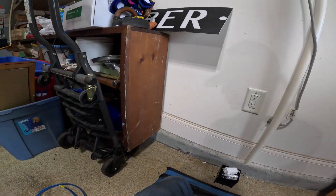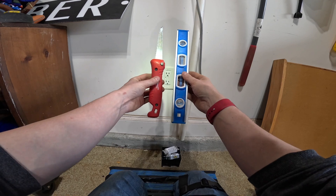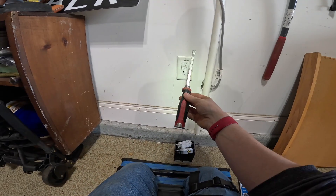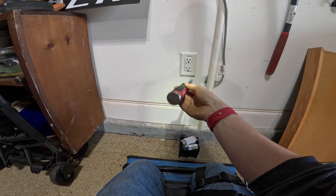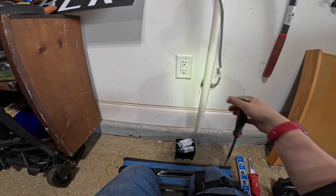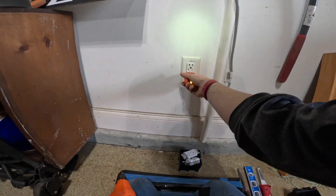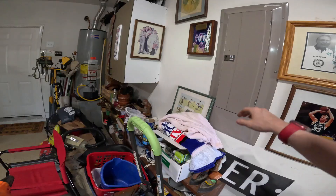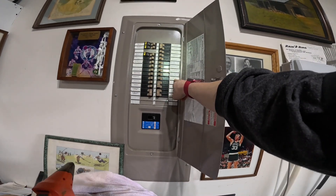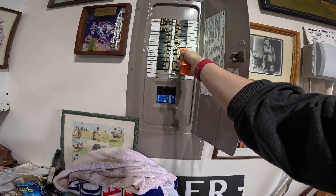For basic tools, you're going to need a level and a drywall knife, drywall saw, or jab saw. You're also going to need a pry bar — I'm using one of my old beater screwdrivers to pry the old box out of the wall. And I'm going to use my Klein Tools circuit tester here to track down where the breaker is. It's right here, and I can see that this one has the same dedicated label, so it seems likely it's the right one.